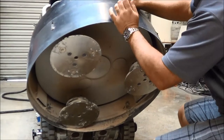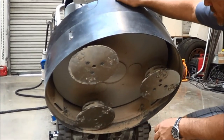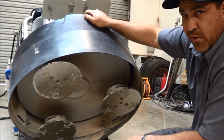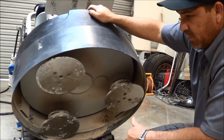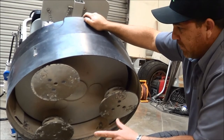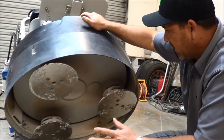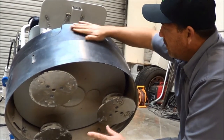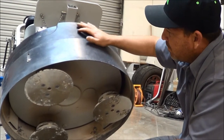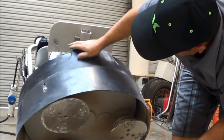It has a floating shroud — not a steel shroud. The reason we like these shrouds is because they flex more. If you hit something hard enough with a steel or metal shroud, you're either going to dent it or shatter and crack it — especially cast metal, it will crack. So we use a poly plastic material that's very durable and strong. The shroud adjusts up and down so it floats with the floor.